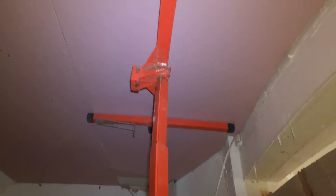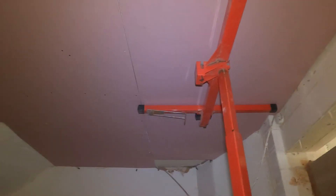What we're doing here — this plasterboard lift is so much easier because it's quite high in here. You can simply place the board on it, jack it up into place, leave it there, and screw it up. You can do it on your own or with two people, and that's it — nice and easy.